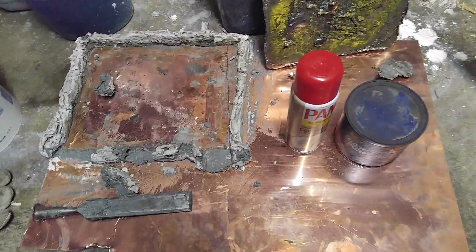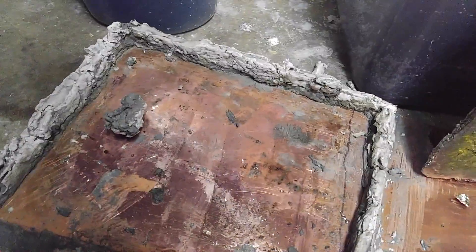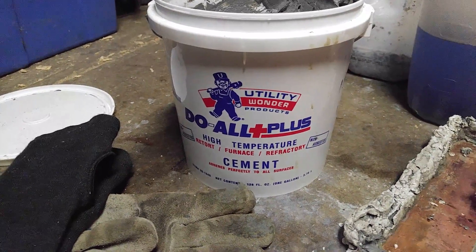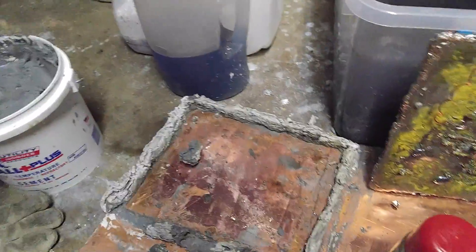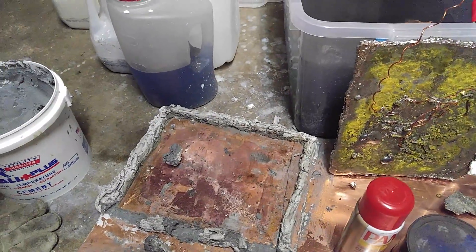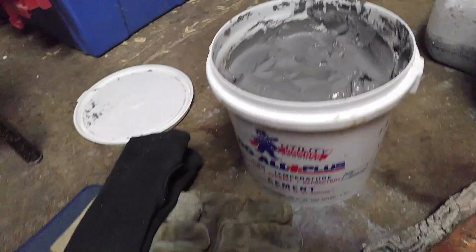In my case I found copper works the best. As you can see, I use a molded wall that I made using something called Do-All Plus — it's good for up to three thousand degrees and doesn't even flinch when you pour molten bismuth on it. It has done the job the first two times so I continue to use it. That tub cost me thirty or forty bucks and as you can see there's plenty left.